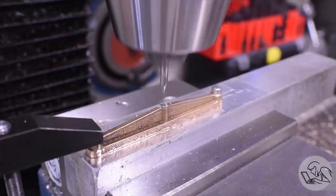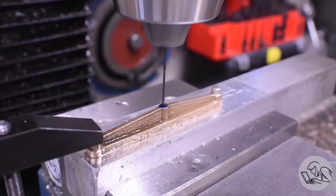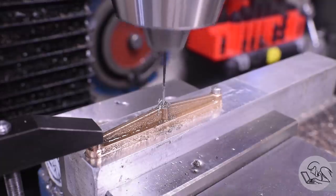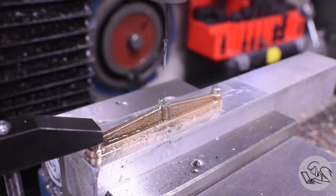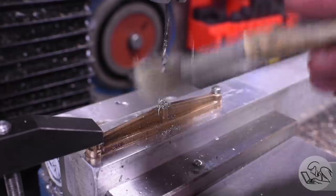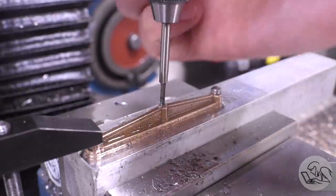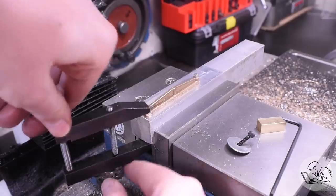This hole in the middle is an oil hole - there's an oil cup that sits on top of it. The oil passage is a very tiny drill - actually a PCB drill size. This was a bit sketchy because my mill really doesn't run fast enough for a drill this small, but I was able to get it done by being careful. Then I drilled the top half of that hole to tapping size and tapped it for the oil cup.